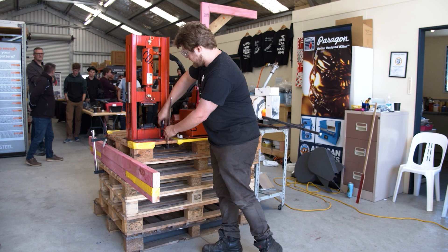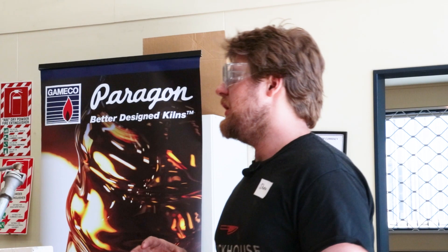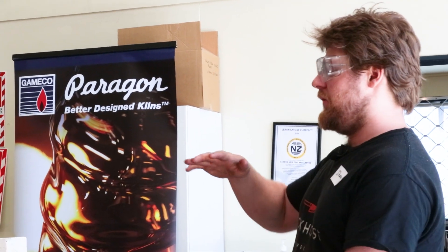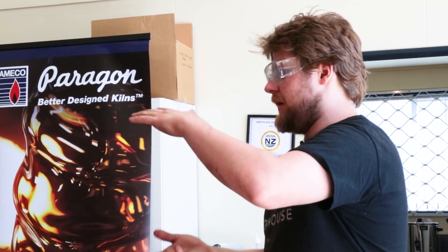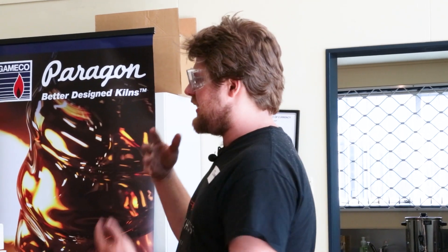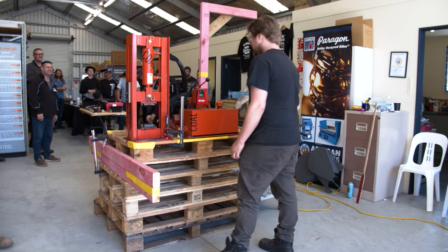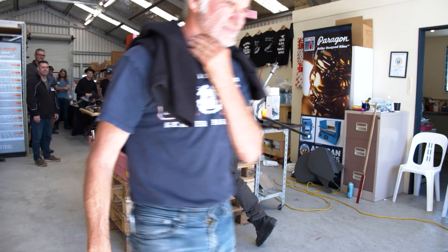If you're doing larger stock that's where it starts to really not work as well. If you're doing very thick stuff and upsetting, or very very thin stuff, it seems to suck the heat out quite a lot as well. So it can do most things - as I said, not everything. A big thing to note is you can actually have the press set up two different ways.